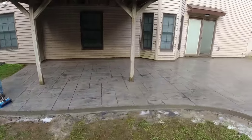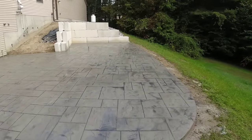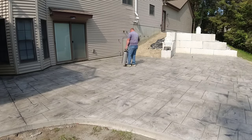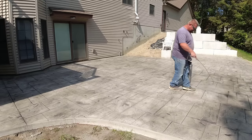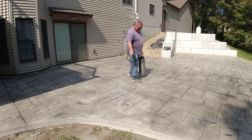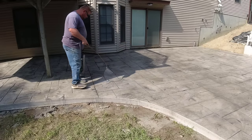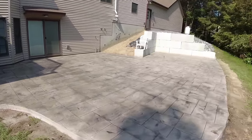You walk away, let it dry, come back in a day or two, and put the sealer on. You can put as much or as little as you want - you could put two different colors on if you want. We've done wood plank with black and then a walnut-colored texture enhancer and that looks really cool. Now here we are 48 hours later - we waited two days - and this is actually the third coat of D1 concrete sealer from DeoCrete we're putting on. We put three light coats on, about this pace right here. It probably took seven, eight, nine gallons total and three coats for this thousand square feet. You can reseal this at any time - a year later, six months later, three years later, it doesn't matter.